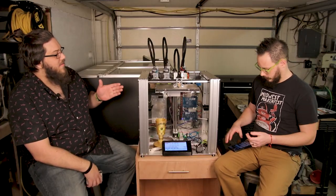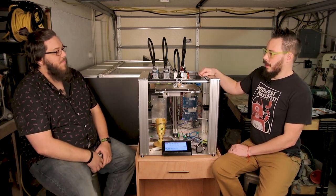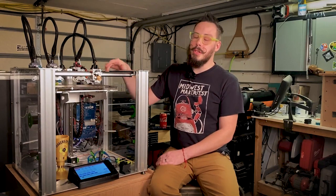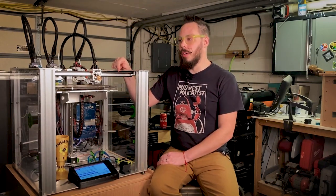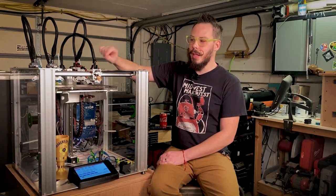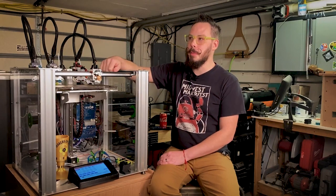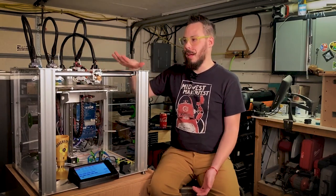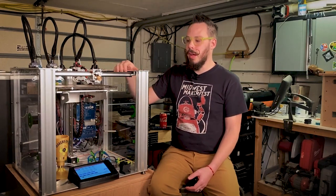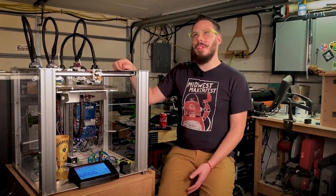So when it comes to having something that's reliable, that holds the tool head and everything like that, what happens when that doesn't work? What happens when a tool drops? So, since I've converted to the retail spec, I haven't had a tool drop. Okay. On the beta spec, I had a little micro switch here that told me whether or not a tool was present. And when a tool dropped, it would park the head, cool all the tools down and put everything in standby mode and just wait. I haven't implemented that yet in this, but that is the expected behavior, that you would set that up. For some reason, E3D doesn't give you that capability out of the box.